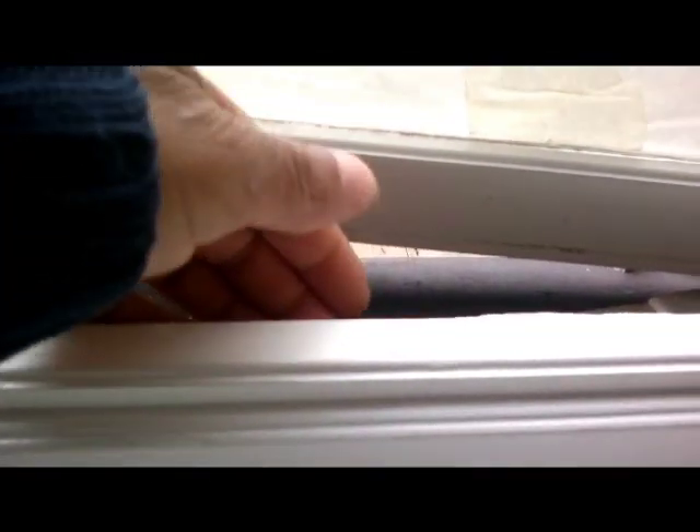When you're painting your window, always remember to open it. If you don't, all around here along the bottom — you can see the line — the paint will miss because that's all hidden behind the frame. When you open your window after painting it's going to look crap. Also make sure the paint is dry before you close your window so you don't end up with marks on your paintwork.